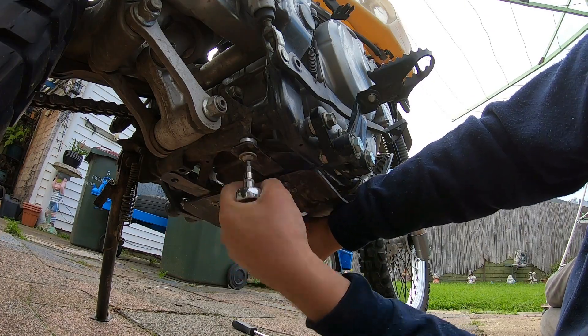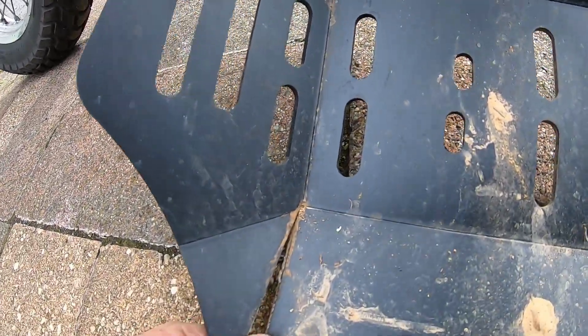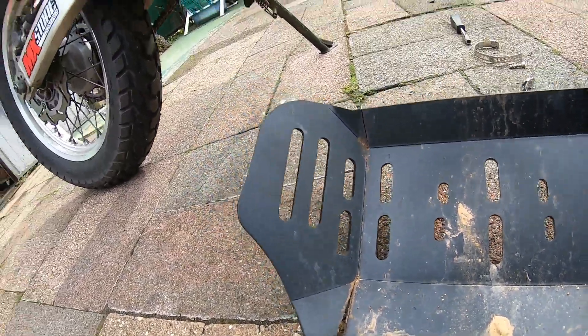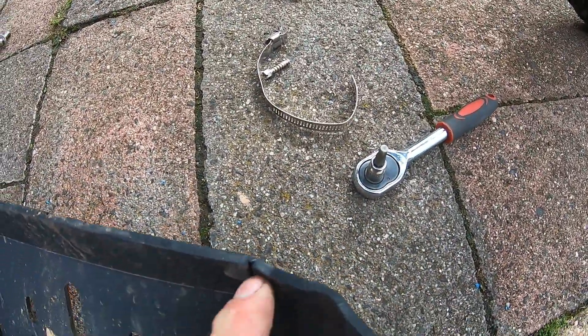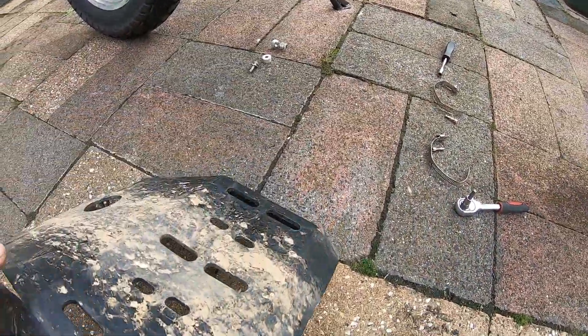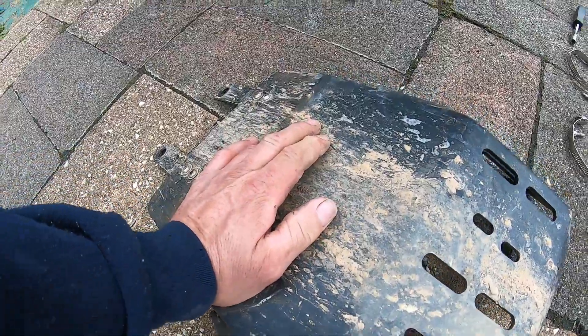Should have saved my money and bought a better one — I've just wasted 85 bucks on this one. You can see it is split pretty bad. I'm guessing that pushing up there has pulled that out. You can see here how it's cut and the welding doesn't even penetrate right through. If it was welded up properly it might have been all right. That's your 85 dollar eBay plate.